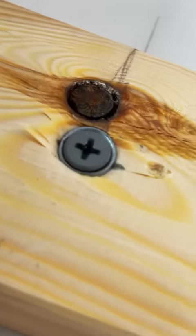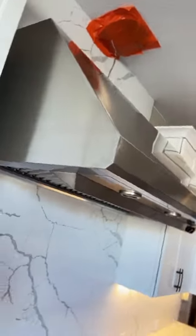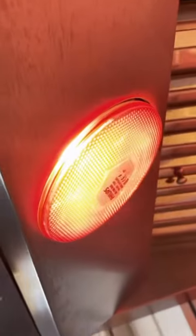We're going to use four-inch screws to secure it to the studs so that one-by-two board is going to be super strong. Now we can just go ahead and lay that hood shroud on top of that board — just make sure not to forget the electrical. Now we're screwing the hood shroud to that little one-by-two board. Remember, that one-by-two board is hitting all the studs so there's no way that's going to fall down. Now we just got to make it look a little bit more presentable.